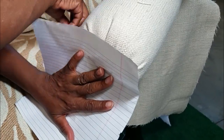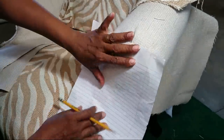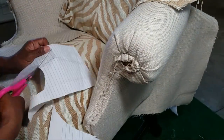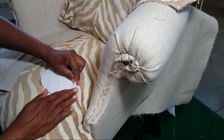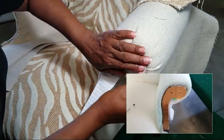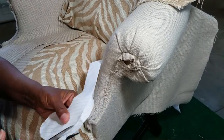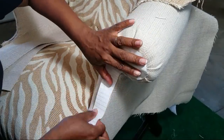Now you're not going to believe what I did to get my arm panel done. I basically took a sheet of paper, laid it in front of the armrest, and traced it with a pencil from underneath — no ink, because I don't want to put any spots on my chair. That basically was it — that's how I created my template for the arm panel. I wanted to make sure that the panel was in alignment with the wooden surface underneath because I am going to apply tacks to that area. Next time around I think I'll create my panel before I apply fabric.